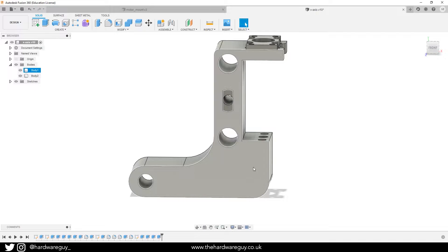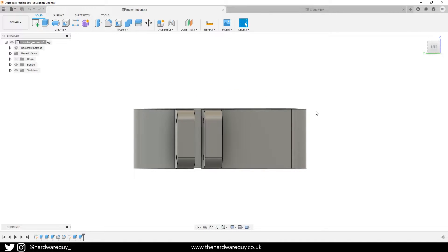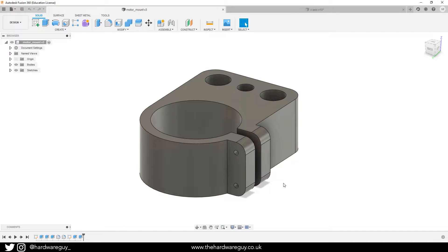For the additional extrusion at the bottom, I wanted to make it as strong as possible given that it's plastic. I printed it with a very high infill — 80 or 90 percent — so it's extremely rigid without wasting too much material. I printed it in PETG and honestly it is very, very strong, if not stronger than the original part, with no flex when force is applied to the spindle. I also created my own design for the motor holder — minimal height to keep the majority of z-axis travel, with two holes for bolts that clamp down onto the motor. I know some of you raised concerns about the plastic melting while the spindle runs, but I haven't had any issues — the motor isn't getting that hot. That said, I'll keep an eye on it when using harder materials that will draw more load from the motor.